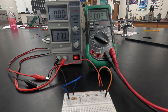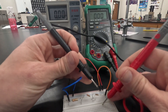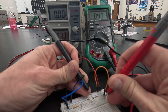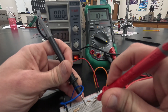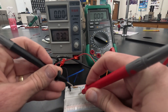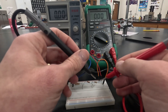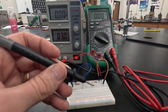Next we're going to measure voltage across each resistor. I'll put my red positive probe on the positive end and my black probe on the negative end of each resistor. For the first 100 ohm resistor we get a voltage of about 0.47 volts. For the 220 ohm resistor we get about 1.04 volts. Then finally for the 330 ohm resistor I get a voltage of 1.56 volts. You just place the probes on each side of your resistor to get your reading. Next we'll do current.